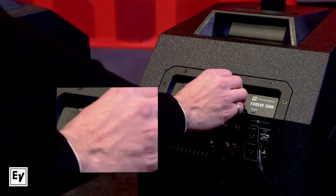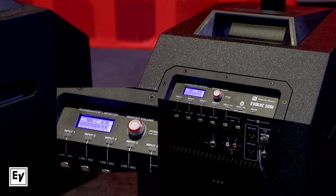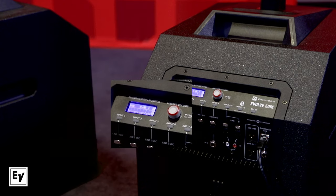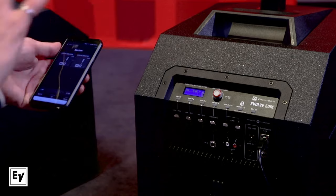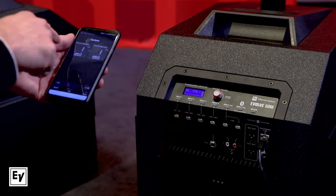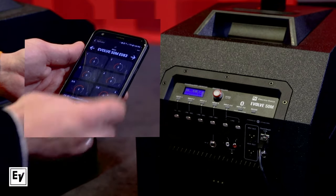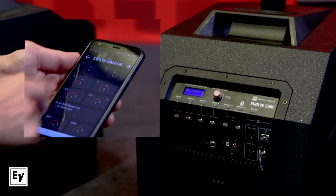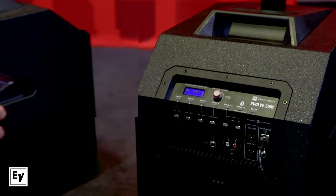You just pick which it is for the house stereo — what the audience will hear — click there and you're done. That's all it is. Now the two units are sharing the mixer section, so you can plug in your guitar to the left and mics to the right, and you'll see all inputs in the app. You can control all inputs from the app — once linked, you go into one and edit the mixer. You have the eight channels on one unit, and with a simple swipe you're on the second one, controlling all inputs as if it were just one larger mixer.